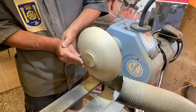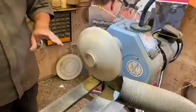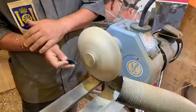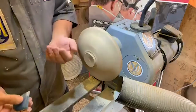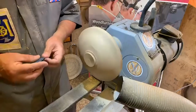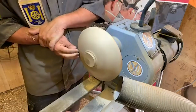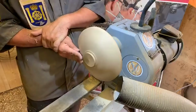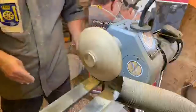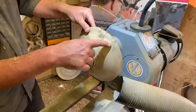When it comes to cutting, your safety is the most important thing. That's primary. Safety is everything. The bowl will only go so fast. It'll either come off the chuck, make the machine vibrate too much, explode, all sorts of things can happen with speed. So it's one of those things you have to control. But the faster you go, the better the finish will be. But like I said, use those words wisely. A little bit of tearing here we're going to get rid of.